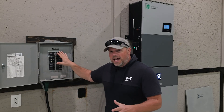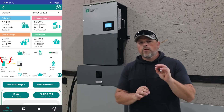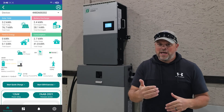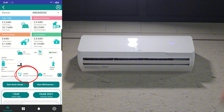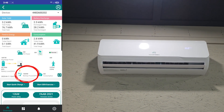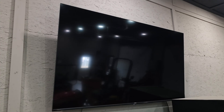That would be my fault for not putting a large enough transfer switch in here to handle everything turned on at one time. However, that's the way this is designed and it should operate — if you start to overload this breaker, you will trip the main if you go over 50 amps for a certain amount of time. So we're going to start out with around 82-83% state of charge on the batteries and put this through a rigorous load test. The first thing I want to turn on is the 240 volt mini split in heat mode and turbo mode so it will consume the most amount of energy possible. Next I'll do the same thing with the 12,000 BTU 120 volt mini split, and I've set that to 89 degrees so it shouldn't turn off during this test.